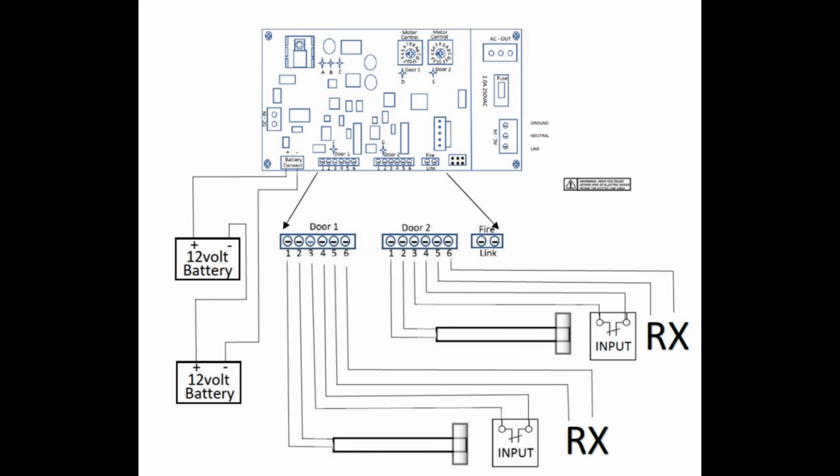Okay. Well, I'm going to do a little bit more mechanical adjustment. It seems like door one, every time I've tested it so far now, has fully retracted the rods and held them. But door two, I'm going to do the same thing, some mechanical adjustments, and see if I can get that one to do it every time. Last time I was here, we were thinking the power supply was going bad, or no, it was a panic, so that's why I reversed the channels. And like he said, he didn't have an issue until this week. It just started, both of them having issues.